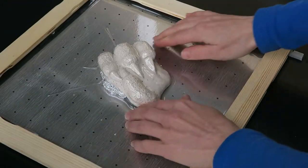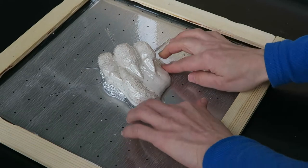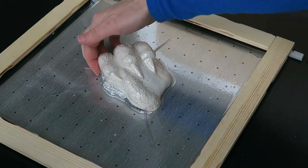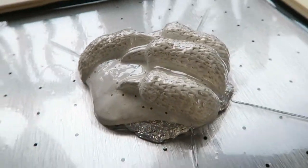The smaller size is much easier to work with and gets good detail. The clear 0.02 inch PETG is more finicky with the temperature so I kept overheating it by mistake and getting too much webbing. But after a couple of tries I got a pull where the part I needed came out clean.